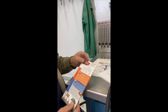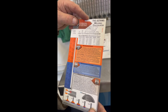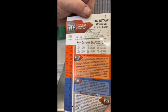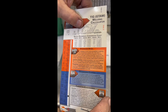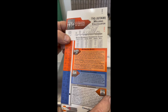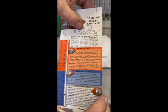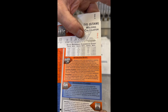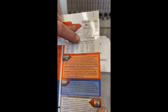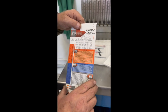Then on the tungsten sizing, we have a chart that we use that tells you what size tungsten diameter you should be using for whatever material you're welding. And this particular chart has a sliding deal, so you can zoom in on whatever kind of procedure you're going with, whatever kind of gas, whatever your speed is. There you got a 1/8 inch tungsten telling you the cup size. Filler rod should be 1/8 also. We're going DC, and the amperage range is 250 to 280. They say type, you got helium there, but we're all using argon on everything. And then your flow rate in cubic feet per hour is 30. And then it's got a feed rate, and then your speed, which is based on how you're doing it personally.